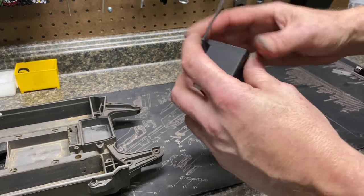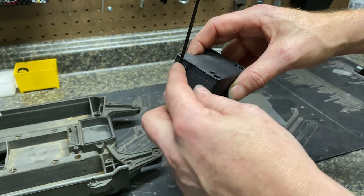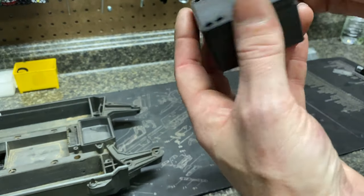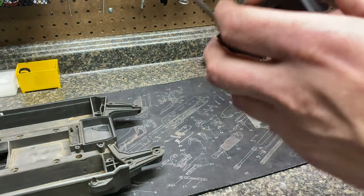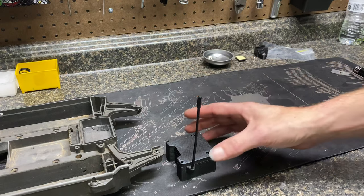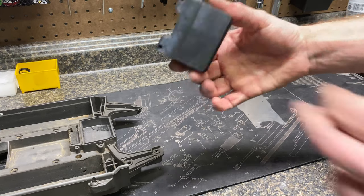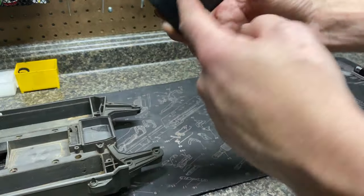The receiver box comes with your antenna tube mounts on the side. It is a little tight — I took a drill bit and opened that up just slightly to get a tight fit. You've got a hole in the front and a hole in the back for your wires to pass through. You can seal this up waterproof if you want with some shoe goo, or I'm just going to use a little silicone to make it nice and watertight.